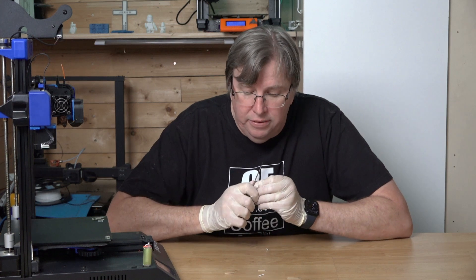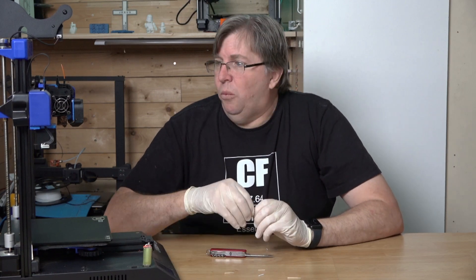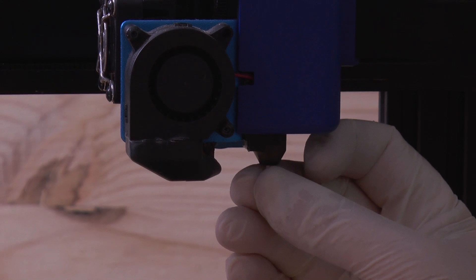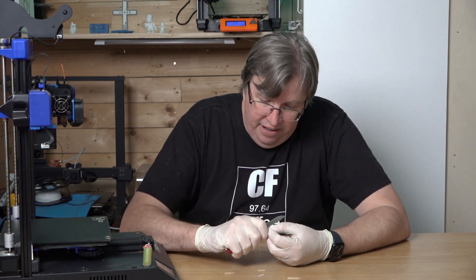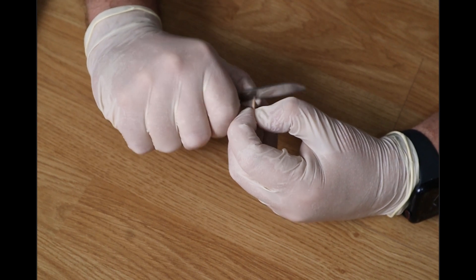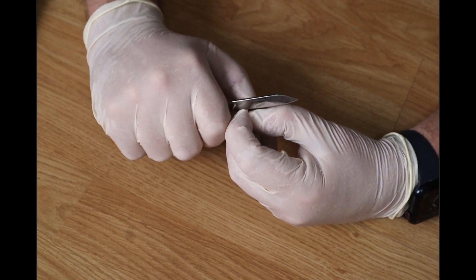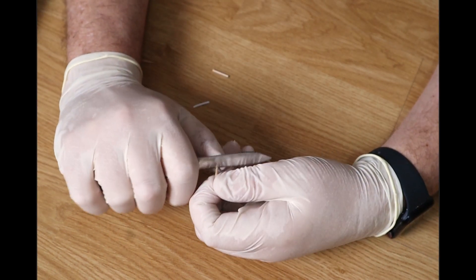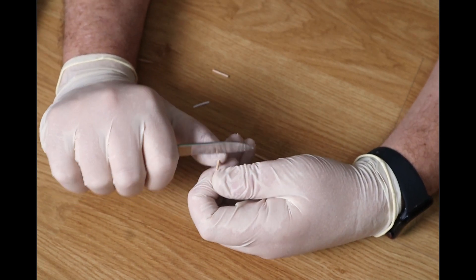Let's take the knife and just score and mark it there, then gently push down until it cuts through. Now I've got my piece of toothpick. Let's just check it with the vernier — yeah, it's 16 mills. I'm going to clean up around the edge a little bit, make it a nice clean cut. But when I try to put this into the hole, it doesn't go into the little teeth in there — there's a little piece of metal folded around that it will not go into. So what I've done is take my pen knife and scrape all around the toothpick, going all the way around, taking the smallest amount of wood off as possible. We just want to reduce the diameter a little bit — keep going around until you reduce the diameter enough so that it fits nice and snugly into the receiver.